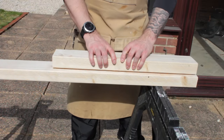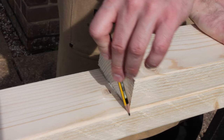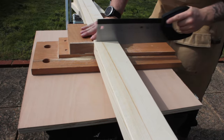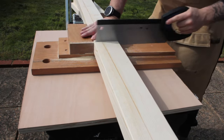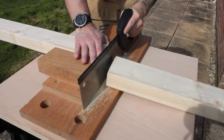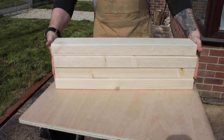Damage on the leg fixed. I then used that leg to measure out my next piece. Using a mitre saw or a table saw you don't need to do this because you can use a stop block, but this allows you to measure exactly off the workpiece when cutting by hand and minimise human error to end up with four square pieces. I then proceeded to finish cutting the legs out with a hand saw — felt I needed the remedial work after the mess I'd made of the first one. This didn't take long and I ended up with four nice even pieces.